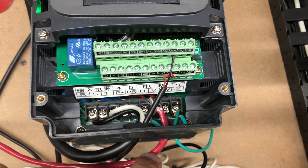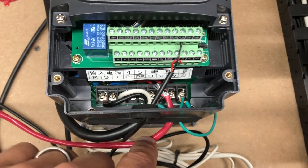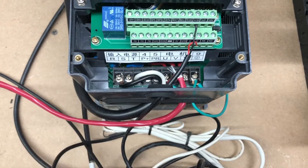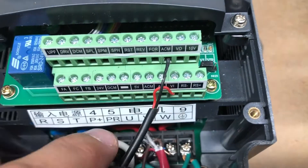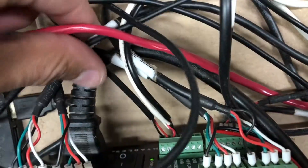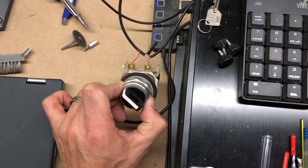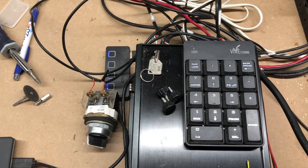The spindle cable uses shielded wire — I bought this at Home Depot, it's very cheap, about 49 cents a foot. You don't need very much, maybe 10 to 15 feet. Get more than you need. That shielded wire gets wired to U, V, and W — simple. The two wires, ACM and VI (or V1), get wired to the back of the X controller into the ground and the PWM. I also have another cable coming out of the 0-to-10 port going to a relay to control my vacuum, and an Allen Bradley on/off switch for when I'm using the laser.